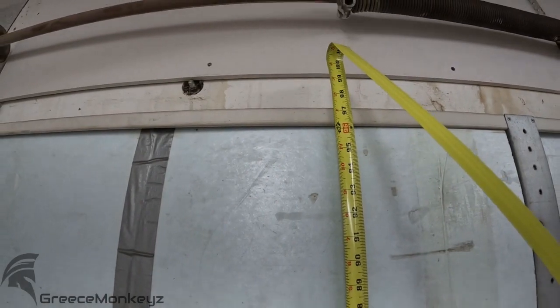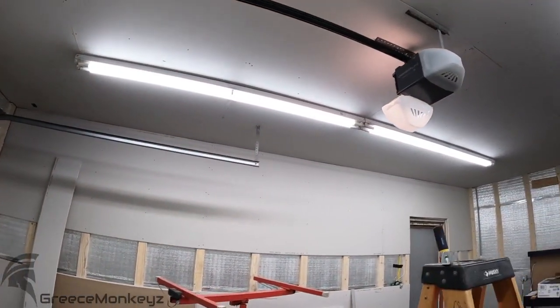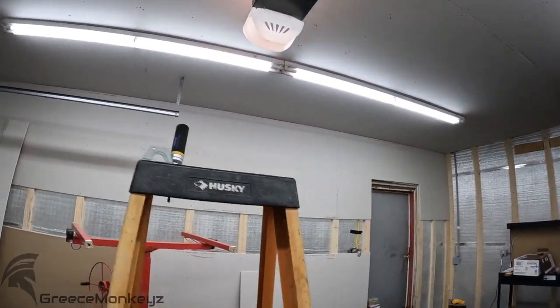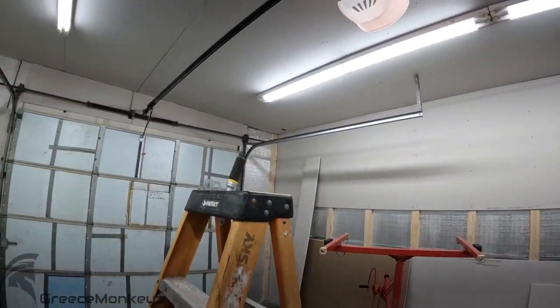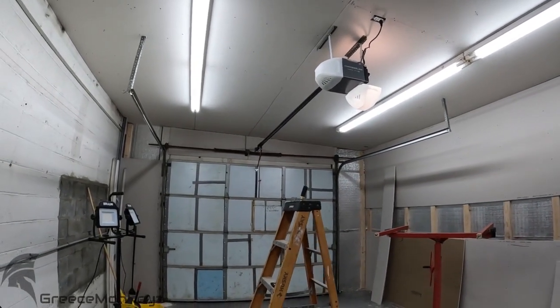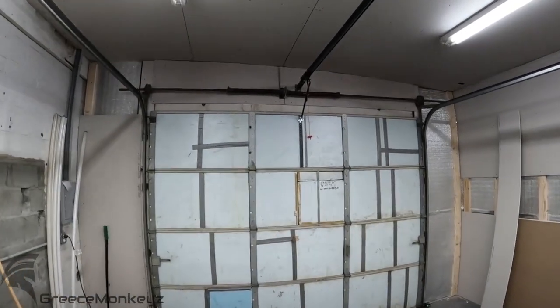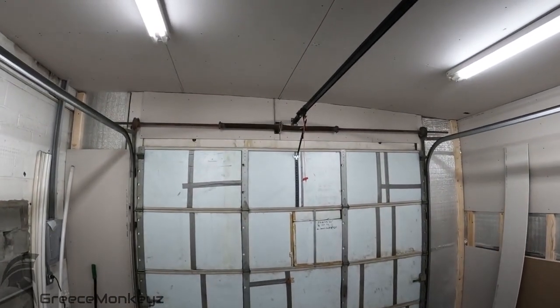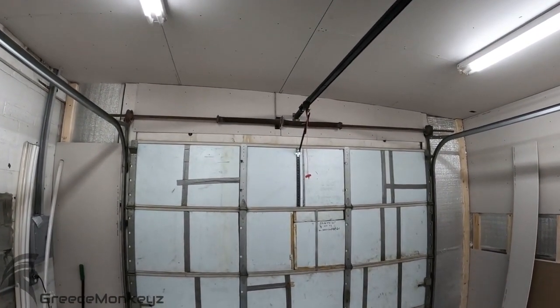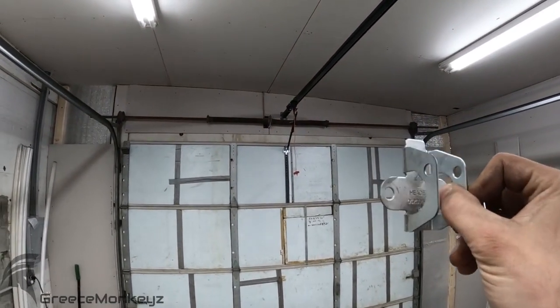There you go — on the floor all the way up, 97 inches to the top of the door. The opener is a seven foot model — that's how they come. I didn't get an extension kit. So there you have it — save yourself like 60 to 80 dollars, wherever the extension kits are. If you're a little bit handy, get it done. If you want to do it simpler than me instead of making a metal bracket — I also had to make a longer pin because the bracket is thicker — you can just use the stock bracket and space it off the wall.